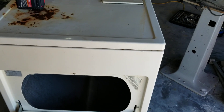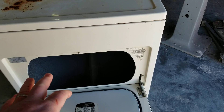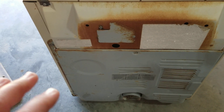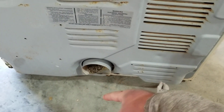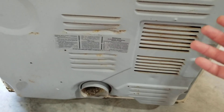You'll save all the labor producing this thing and have a work area the rest of the year. You do lose all the storage underneath — that's the worst part. The other thing you'll want to do is direct the heat that comes off this thing into your shop using an elbow or normal dryer vent, however you want to do it, so it's not immediately sucking the already heated air back in and reheating it. You want to get as much air out as high as possible in your shop.